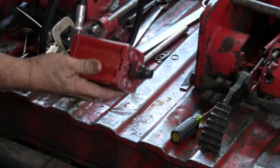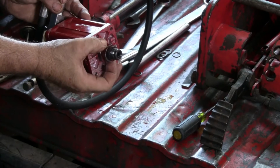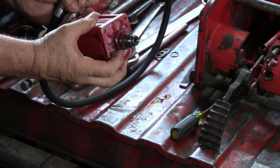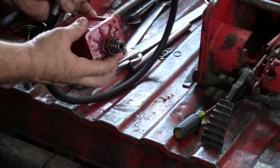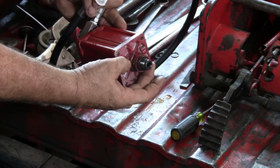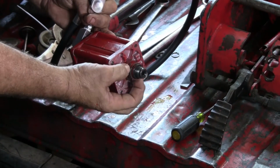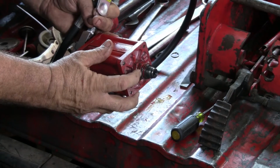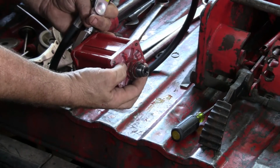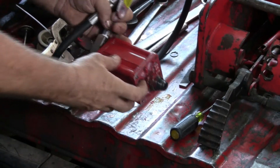Air motor assembly. Okay, this hose swivels, and this piece I'm going to screw back in swivels, and then I'm going to tighten this large nut flange up when I reassemble it. So I'm going to put it back in the cylinder, tighten against this flange here, tighten it with this hex area, and then I'm going to tighten this. This last 1.25 inch nut is going to tighten it against the aluminum housing.